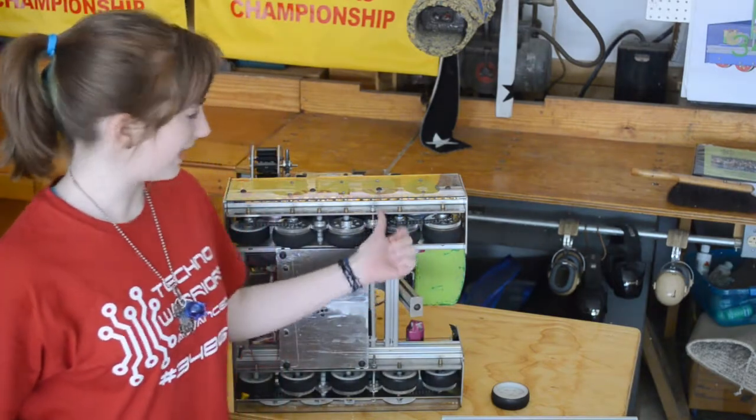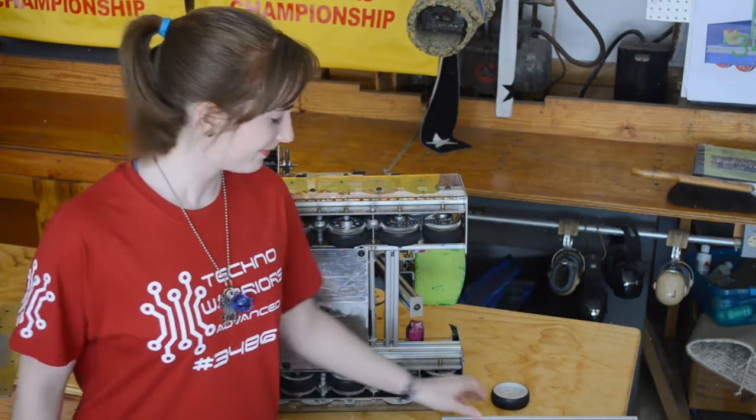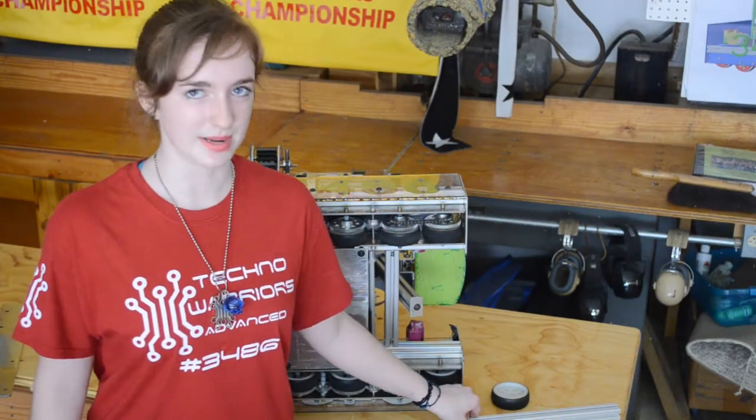Again, if you have a nice 1/8-inch steel plate on the bottom of your robot, or technically 4 1/8-inch steel plates on the bottom of your robot, it's going to help with your center of gravity and generally help you not fall over. Please note that we have fallen over twice this season, but we improved that. But center of gravity was the main thing.